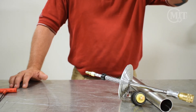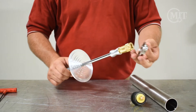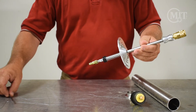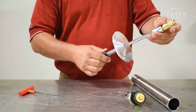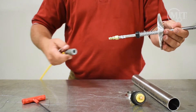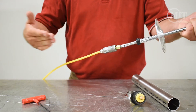The purge wand is designed for welding short ferrules to tubes. It can also be used for short 90s. There's a little allen screw right here that adjusts the tree up and down — that's just for the length of your ferrule to your tube. You hook up your argon to the bottom with a quick release.